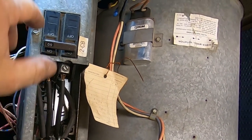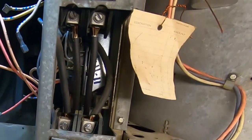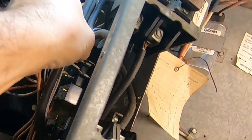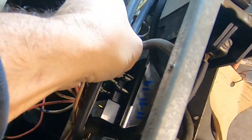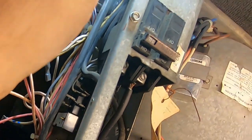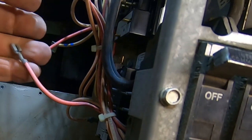Every one of these was loose. You always want to make sure you check your lugs on your breakers. It's aluminum so it gets hot and loosens up — just gotta double-check a few things there. Most of it's pretty well where it needs to be. One by one is sometimes the easiest way — kind of generic but you're less likely to make a mistake than be wondering where a wire goes. Like this one right here — it's not marked, it must have came off.